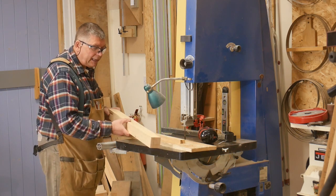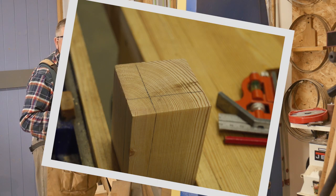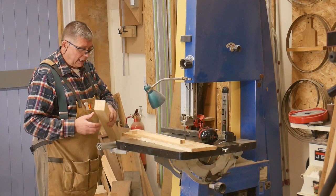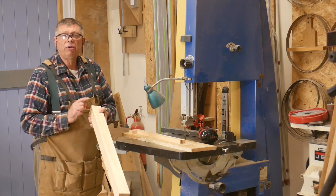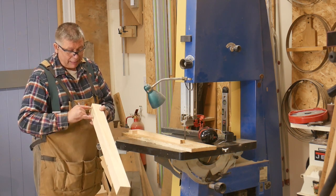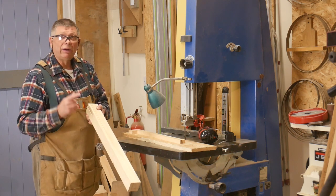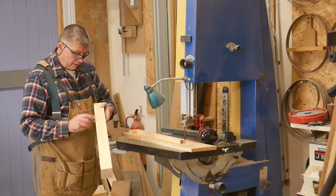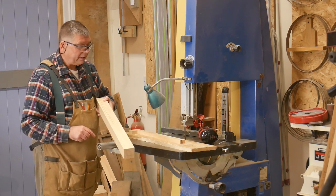So there are two cuts to make and I've done my layout lines — 42 millimetres at the foot and up to 60 millimetres at the top. But I'm not starting to taper right at the very top because my apron is going to go in here. I'm going to start a little bit below the apron, so I've measured down 110 millimetres and drawn my diagonal line at that.